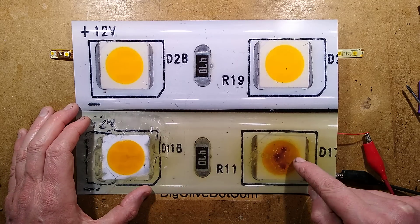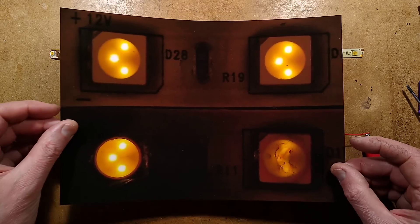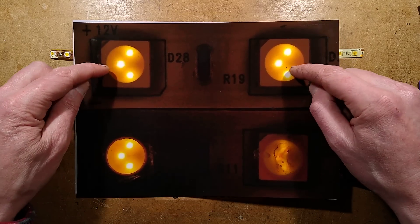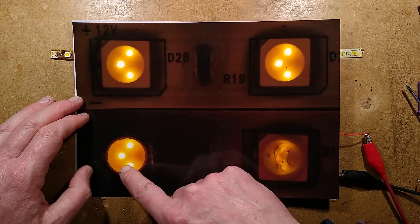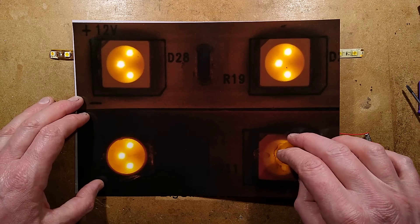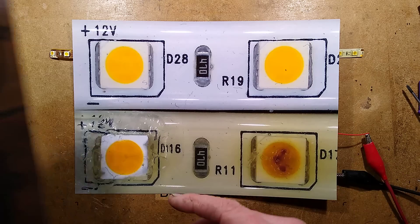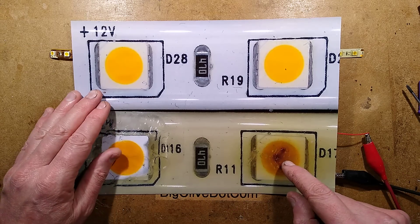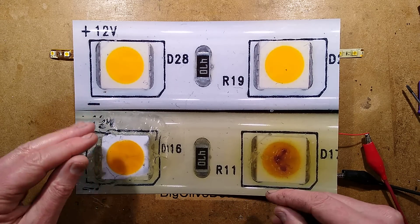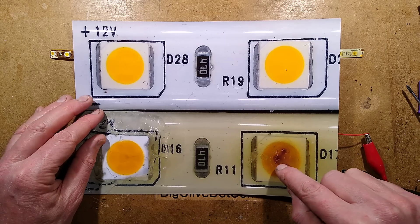This one was really cutting the light down. Here's the new stuff lit — nice and bright, pretty much matching intensity. But the old strip is just a complete mess. It's blacked out above the LEDs and what's actually happened is that gel coating has degraded. It's been affected by the blue, or maybe even close to ultraviolet light from the LED, and it's discoloured and blackened.